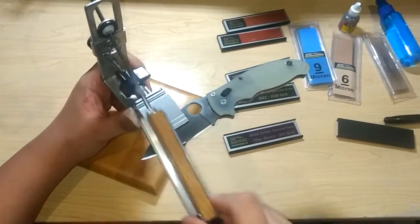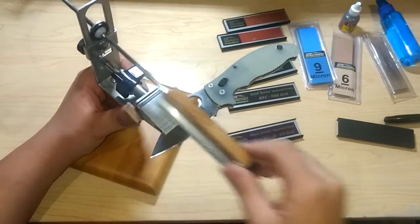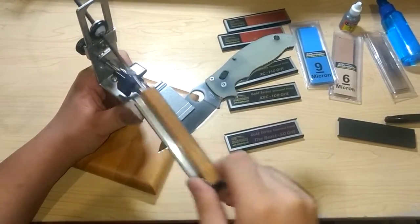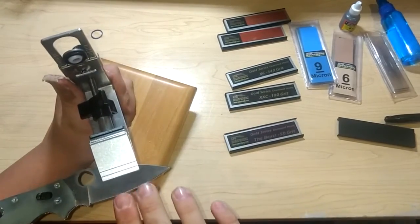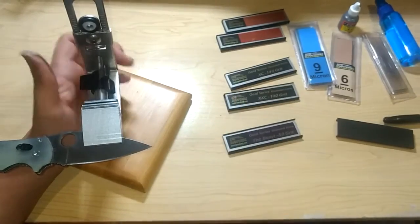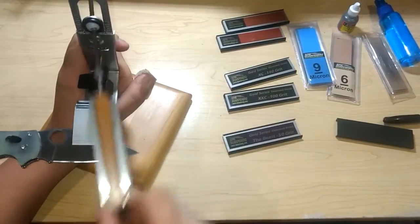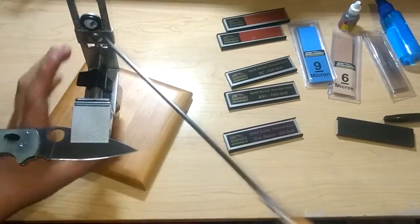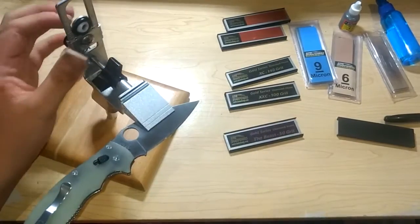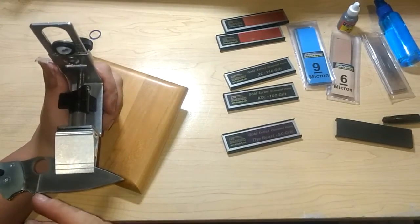So we're still going with the 300 grit stone here. I used to be really bad with the tips on the KME and for the Wicked Edge, for that matter. I'm being much more diligent to make sure I'm getting the tips perfect. And sometimes I think they were just barely swooping off there, just slightly. I mean, just that tiny little bit. I don't like that. They were still sharp and pointy tips to the max. But deburring. I'm doing a full sharpening video here, guys. Oh shit. This is going to be uncut.